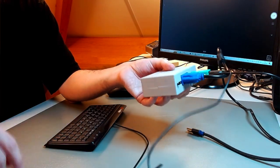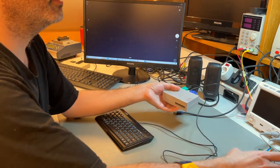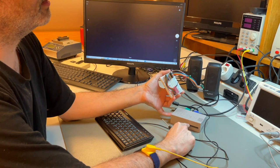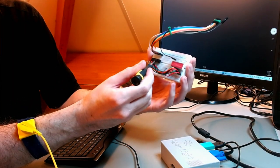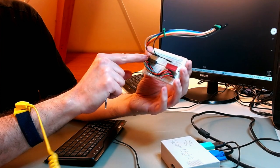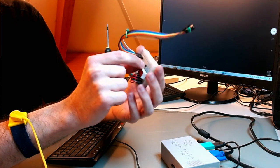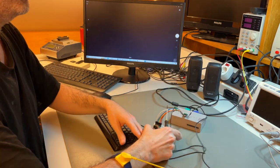Before we power it up, I'll give you a demonstration of using Agon Lite as a microcontroller to control an external circuit. It's a very simple circuit: eight lines plus ground connect to the control port. Those eight lines go through a resistor bank — eight resistors in parallel, one kilohm each — for current limiting. On the other side of the resistors, the signals go to an LED bar with 10 LEDs, of which only eight are used. The other side connects to common ground via a black wire.